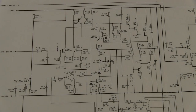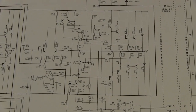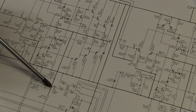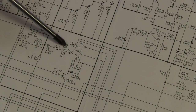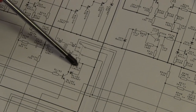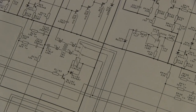So that's the power amp section. What else have we got? Another power amplifier, woo-hoo! Oddly enough. Incidentally, you will see here that this output rail comes down through a big coupling capacitor, 470 microfarad, into our output transformer. The output transformer, well, look, if you're that desperate, yes, you can trace through all of this relay line, but who cares?